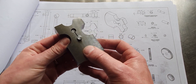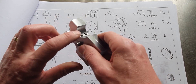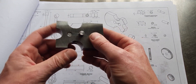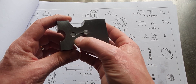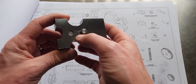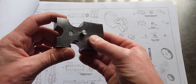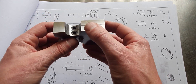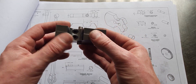I've gone as far as I can with the crank webs. I've done some of the bits of machining off camera because it's just normal sort of machining. With the slit in here, I started the slit off with a slitting saw just to get a nice straight cut rather than cutting through with a hacksaw blade, and then finished it off with a hacksaw - that just cleans the outer edge up so it doesn't look ragged. I also drilled and tapped these for an M6 and then counterbored the tops. So they're all done.